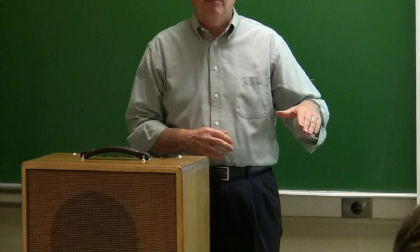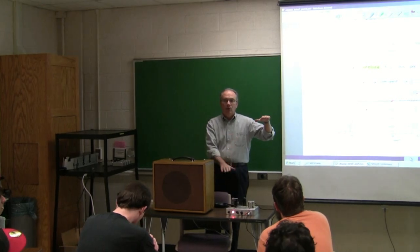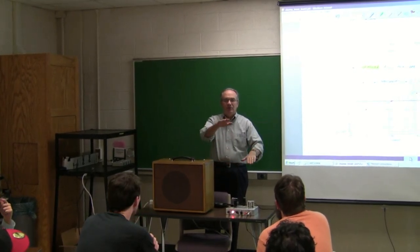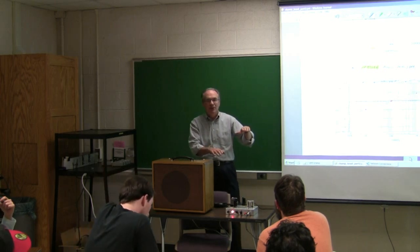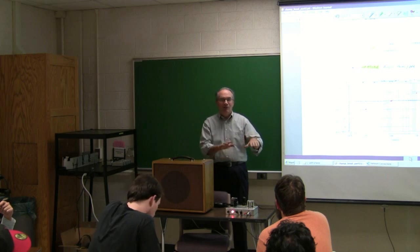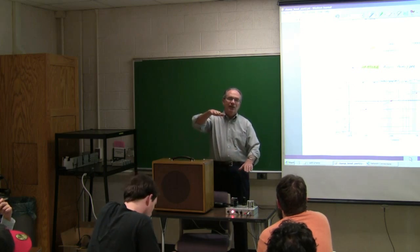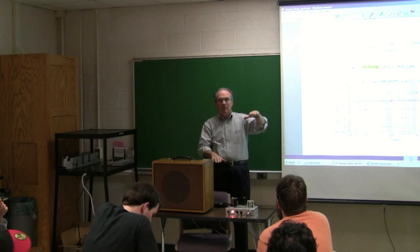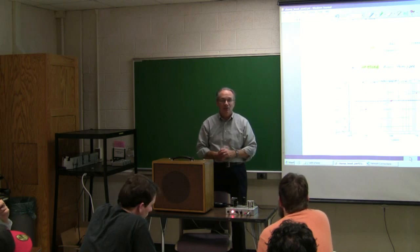It actually is giving you quite a bit of gain for treble. It's attenuating the bass, basically. And so it's giving you the gain you had before, but I'm actually lowering the bass tones. So that volume control is playing with the 2 potentiometers, essentially changing the resistive path seen by the input and output signal, shorting, opening, different frequencies, so you can get more bass, less treble, but the gain's still roughly the same. But the gain I had for the flat band one, just moving one end down or the other one up, just through measurement. And again, you can learn to calculate these things and actually predict the exact same results.